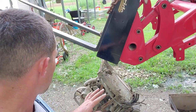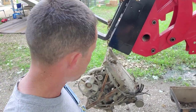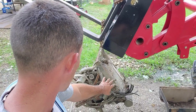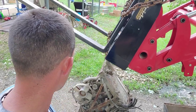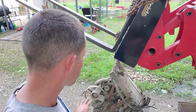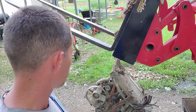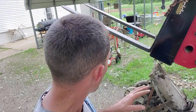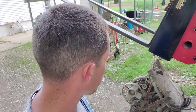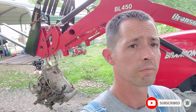In my opinion, the big alternator at the bottom is in a very poor position, and that radiator in the back where all the road grime collects with no way out is also in a very poor position. Wiring and electrical components just don't mix with road grime, salt brine, and water. With that, let's go back and take a look at the Thermo King Tri-Pack and talk about the differences.